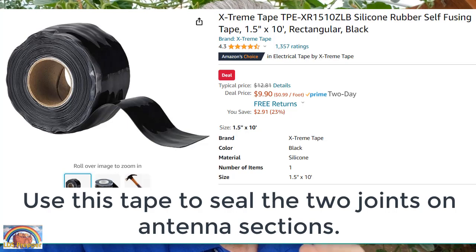Those three examples show you don't need to spend a lot of money to set up antennas — just make sure the antenna is secure. Use a drip loop on your cable like Rick did, and route the cable under the eave like I did so water drips out. Also, I'd recommend sealing any joints on your antenna. I had three sections on my 17-foot antenna, and I wrapped them with self-adhesive tape to keep water out. Everyone who wrapped their joints has had no problems. The one person who didn't literally had the pipes fill up with water despite gaskets. Wrap it with tape if you have multiple sections.